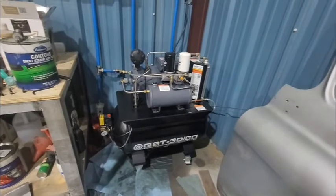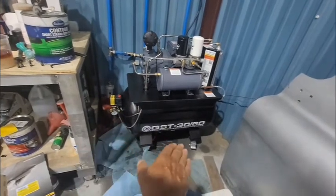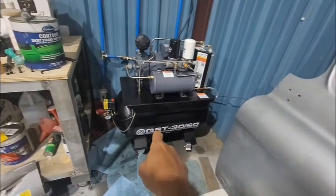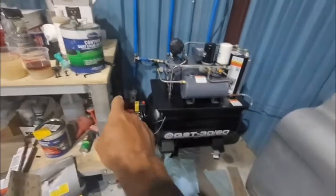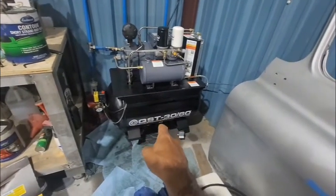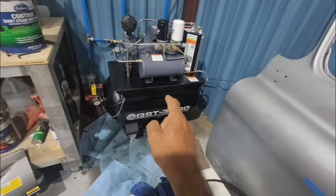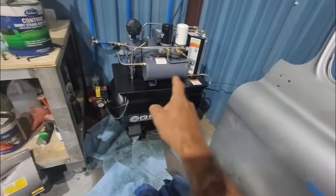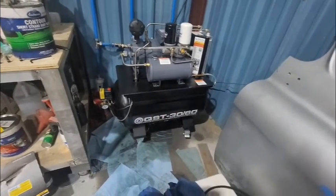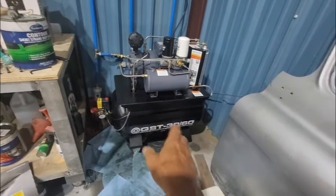If you're blowing oil out right there — it blows all over the place, you won't miss it — this thing is probably filling up with condensation water faster than the separator can handle. I have water separators all over the place on my other equipment and I've never had to empty any of them. I have an automatic water separator that fires off about once an hour, spits out any water, and keeps the tank really dry.